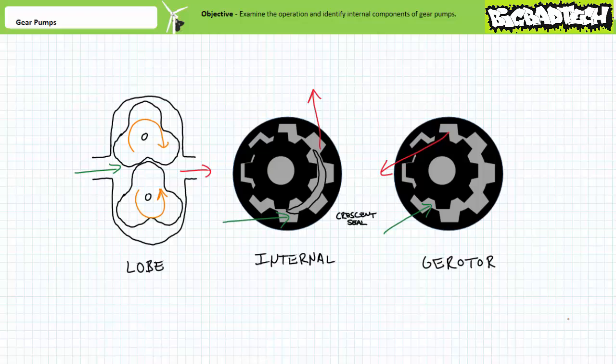External gear pumps, as the name implies, are those pumps characterized by gears with teeth radiating externally away from the body, like the spines of a porcupine. A Lobe pump, for all practical purposes, is an external gear pump, except it uses rounded lobes instead of angular teeth. If you know how an external gear pump works, you know how a Lobe pump works.